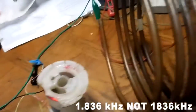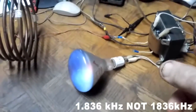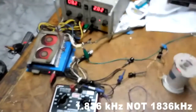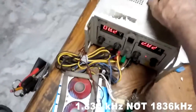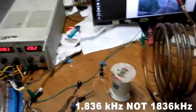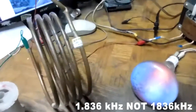I can get the voltage higher, but that's it. The little thing is not going to pull anymore. All I've got to do is figure out how I can get this voltage from here — I've got an extra output on the transformer. How do we get it from there? Back to the power supply. It might feed itself. This amp runs and it'll get warm. This is what's really taking the beating. I've gotten it pretty warm; I can smell it. That's the setup for 120 watts, at 1,836 kHz.